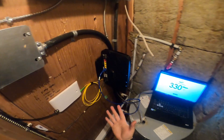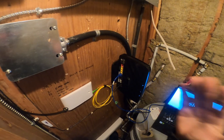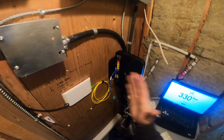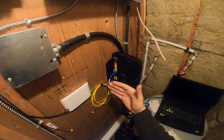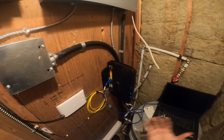So we're back after much troubleshooting. Last time I stopped filming I was getting negative 37 decibels on my light, which is no bueno. So I started tracing myself back — I went and tested right at the media converter inside the house. From the media converter I was getting negative 5 decibels, which is great — perfect. And then at the D-mark on the post I was getting negative 37, the same I was getting here. I go back inside, I put a patch cord into the jack that the media converter is feeding — negative 37. Pretty obvious what the issue is there. I replaced the jack, I test again — negative 5. Perfect. Plug the drop back in, go back to the post and test — negative 37.